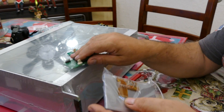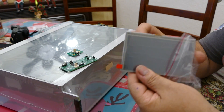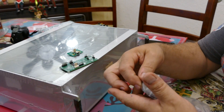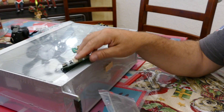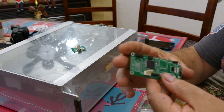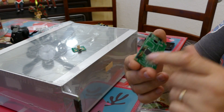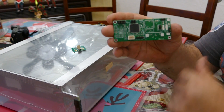There's an LCD display — I think it's a 4.75-inch colour TFT touch screen display with 480 by something resolution, full colour. And this is the board that actually drives the display. There's an Atmega chip on there and there's still an Epson driver chip which I need to source. A couple of other small bits and that'll be ready — it goes between the display and the rest of the radio.